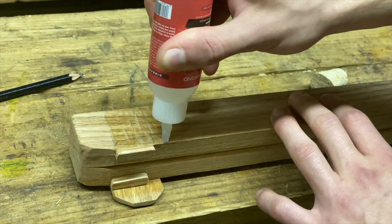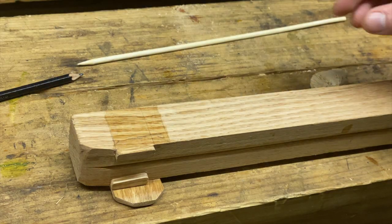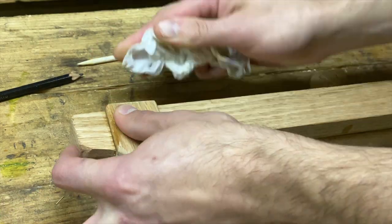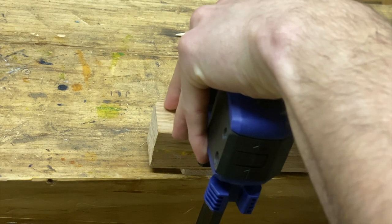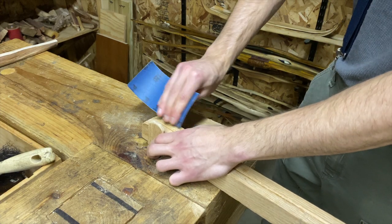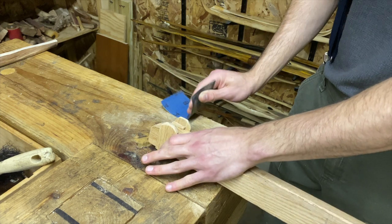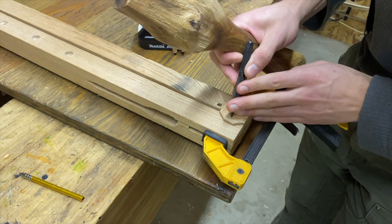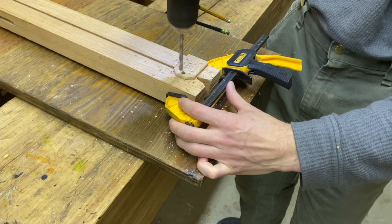Each half of the device is fully functional now, except for optional accessories that you can add for different firing modes. Except, we still don't have a way to attach the two halves of the device, so what we'll do is add these side flaps, and they'll allow us to quickly pin the two halves together. As an alternative, you could screw the two halves together with end caps, like I did on some of my prototypes. The problem with this is that you lose the quick attach functionality, which I found really handy. Right now the flaps are just super glued, but later on I dowel pegged them at an angle, so they'd be more sturdy.